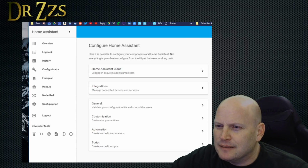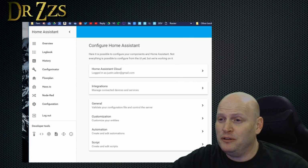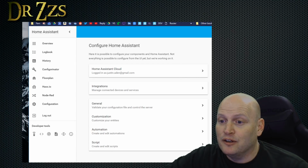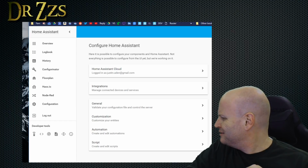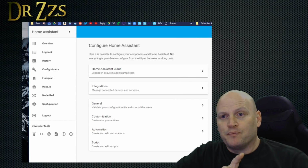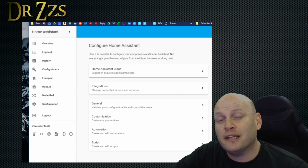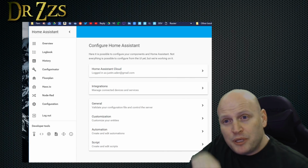All right. I think he used a PWM for one of the GPIOs. If you're asking about the dimmer, how did you add the dimming option on Tasmota? Yes, and Ryan is correct. So what I did was I connected it to GPIO 5, I think, and then I just set it as PWM1.